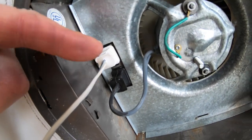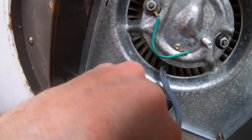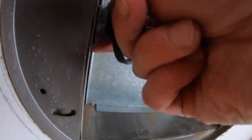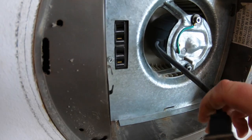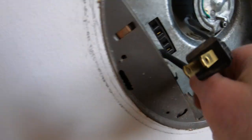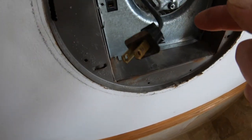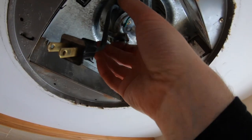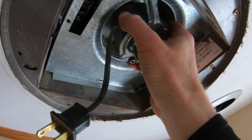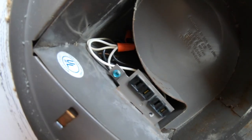One plug is for the light, that one's the fan — so let's get this light out of here. There's a screw right there, a quarter-inch screw. Got it — this one happens to be magnetic, which is not a bad idea. Now this whole thing should pull right out, pull down like so, and out. That's what it looks like up there. Check the wiring to make sure it's wired properly, and it is.